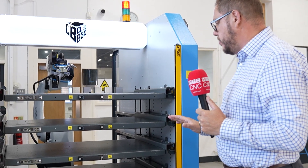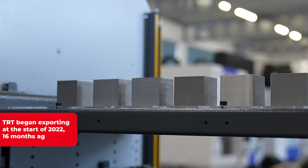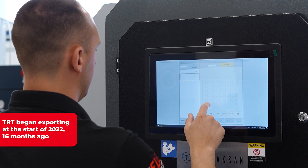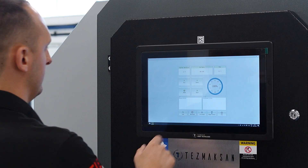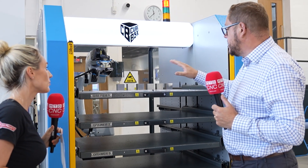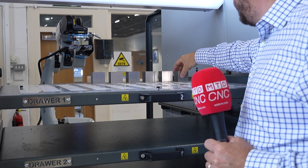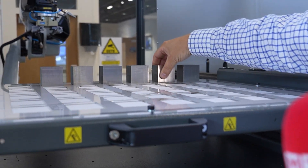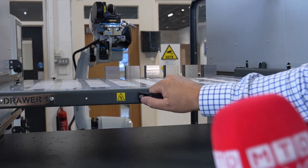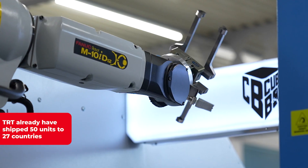It's really simple to use. From a billet-loading point of view, it's a template system across the five drawers. You simply load the billet to the front and right-hand side of the slot in each template. That template is worked out by a CAD-CAM system — there's no teaching required with the robot for that template system. A DXF is loaded into the controller and the robot knows each pick-up point. You pull the tray to position, load the billets, tell the system which positions are loaded, slide the tray into position, and confirm via the control system that it's ready to go. Really simple.